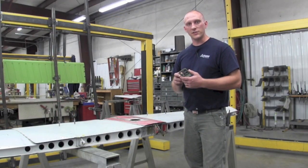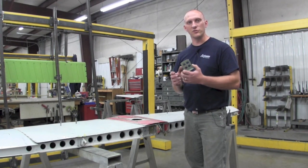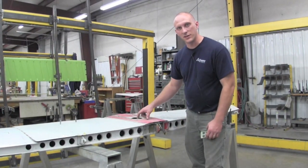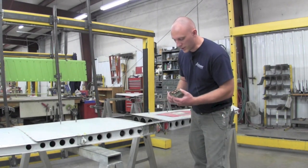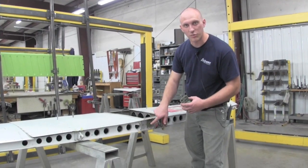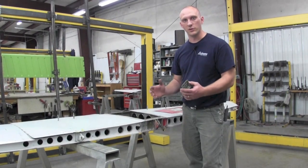To gain access to install these new steel brackets, you'll need to use driven rivets and not blind rivets to attach these. To gain access to that, you'll have to drill all the rivets around the center section skin and remove it. Then you can remove the aluminum box that was there. Make sure that you use some type of epoxy primer to put a barrier between the dissimilar metals — aluminum and steel.